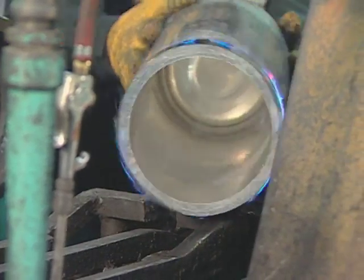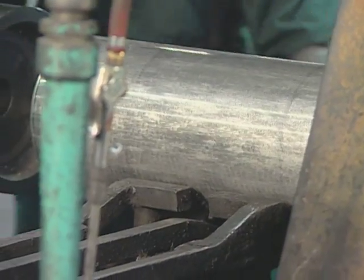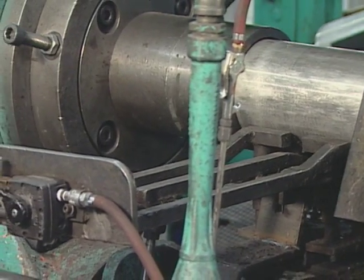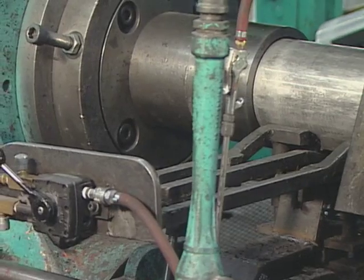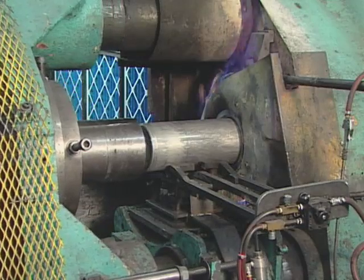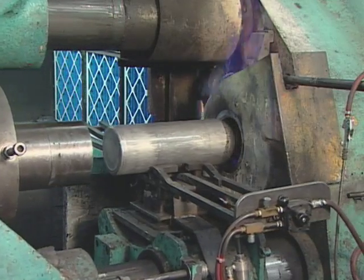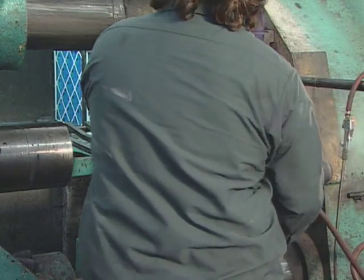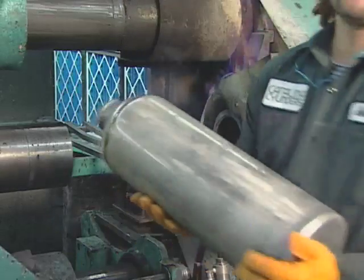Pressing the cylinder into a heated form creates the neck. The cylinder is single-piece construction — no welding. The tanks are then solution heat treated to a T4 condition for one hour. A water quench and T6 aging process hardens the relatively soft aluminum alloy by changing its molecular structure.